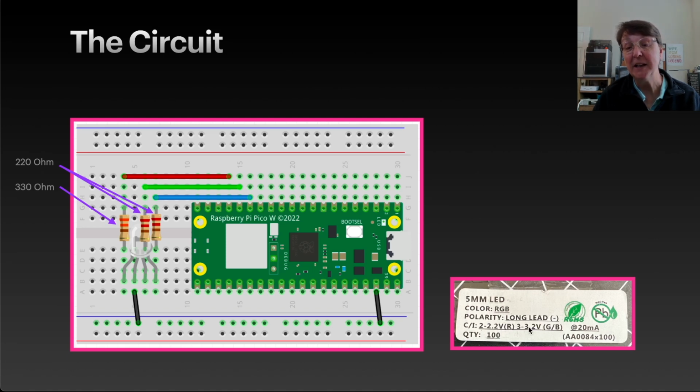The other nice thing is it tells me the forward voltage needed for the red, the green, and the blue, so that can help you choose your current limiting resistor, and I did that in a previous episode, which I'll link below if you want to look at that. So that's nice to keep around, and I actually have that taped onto it so I can remember that these are common cathode and what their forward voltages are.